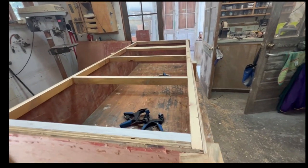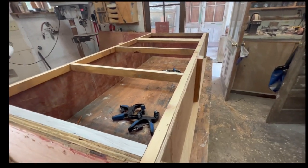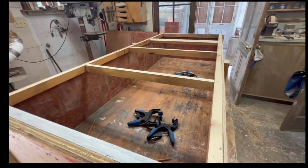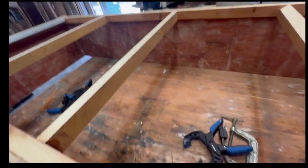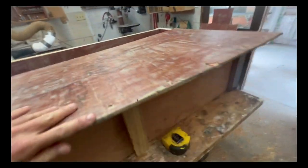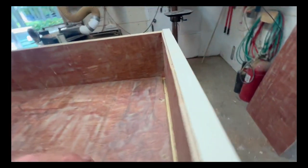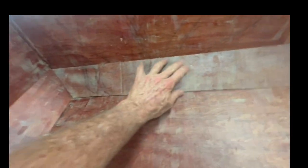Framing for the bottom is done. I'm gonna flip it over, cut that sheet of plywood and drop it in place, put some nails in it, and then put some chamfers on the corners. Got a bottom — let's see if it'll fit. It's gonna be short on that end, but that's okay because the chamfers are in the cover. I'm cutting some scraps and making a chamfer around the bottom so we won't have sharp edges and we won't have corners for solids to build up in.